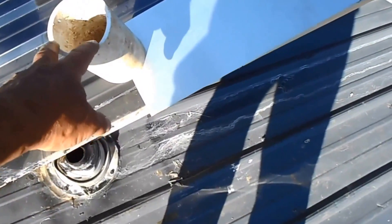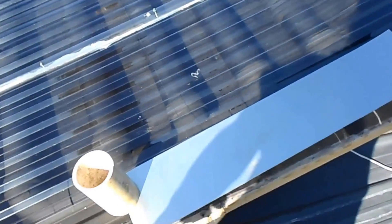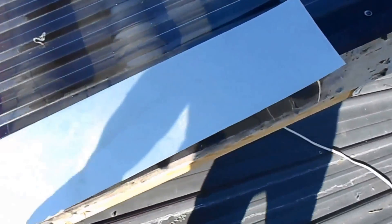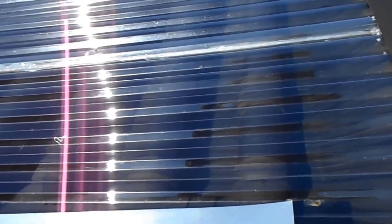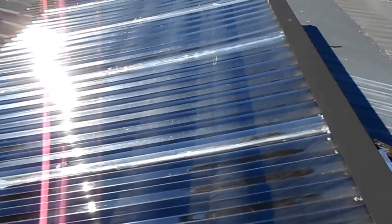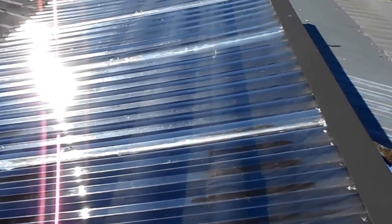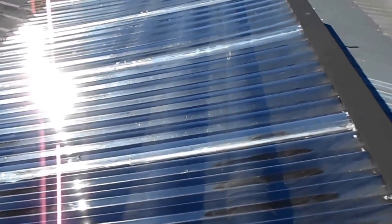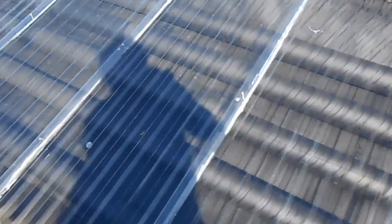I've got the four-inch pipe in mine — the big pipe — with flashing around it painted black. Not because it needed it to get hot, it just needs it to keep from sagging. Without some support holding this up, it'll sag, and everywhere it sags there'll be a pocket of water, so you can't have that. The temperature here is 140 degrees.